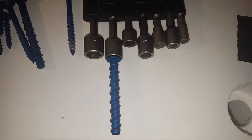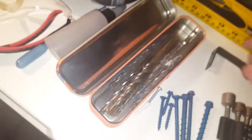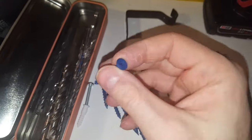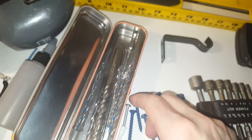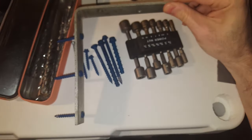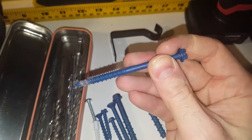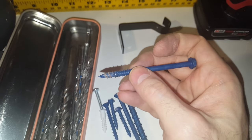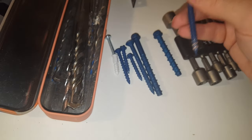Yeah. So depending on which fastener you're using, I'm going to be installing furring strips with the number 3/16, number 2 Phillips, just for demonstration purposes. And also brackets. This is brackets for utility shelving. And if you're going to be attaching a 2x4, you could use one just like this. You really only need a 1-inch minimum embedment into brick or other kind of masonry.